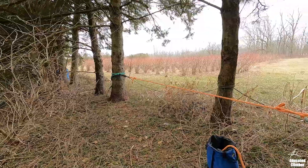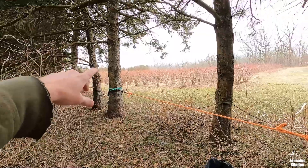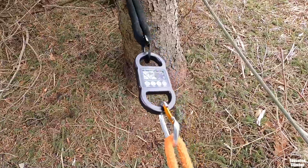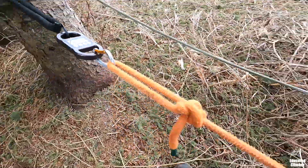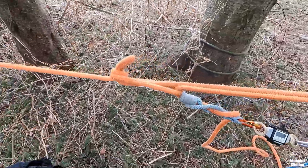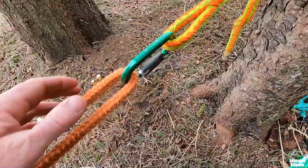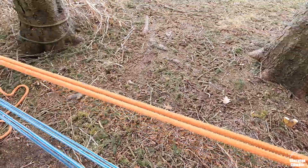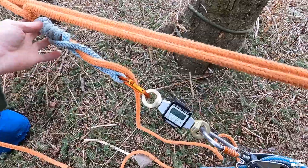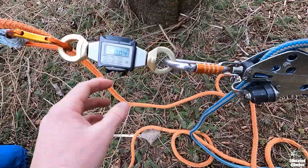So I'm going to show you the rig I've set up here. I have two trees — this end represents my load and I have a load cell on a sling down here. Then I have my line tied with a regular trucker's hitch, rope on rope friction, and it runs back to an anchor point which is just a sling and a carabiner. That's my haul system — a straight up trucker's hitch, nothing fancy. Attached to the input of that trucker's hitch I have a fiddle block five-to-one, and on the end of that fiddle block I have another load cell.